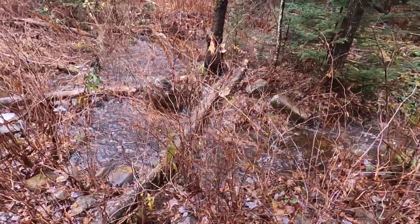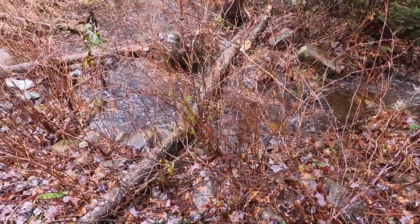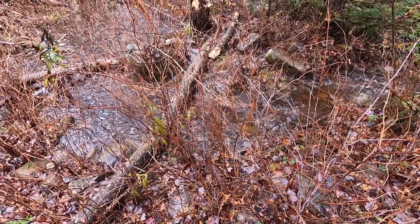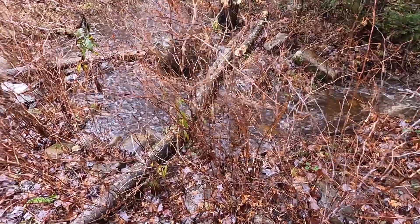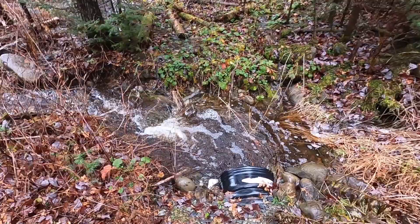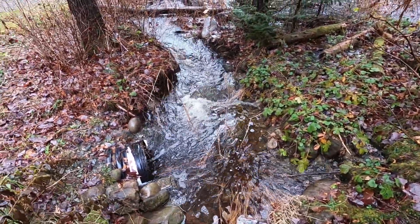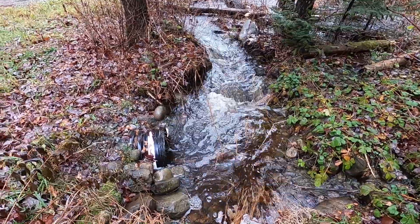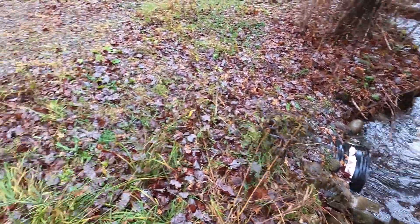I did add a culvert here. This little area will only run when it's raining — normally there's nothing running and it all goes underneath the road through the rocks. But I do have a 15-inch culvert that basically catches any overflow. Because of the rain we've had since last night, it's receiving quite a bit of flow.